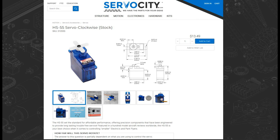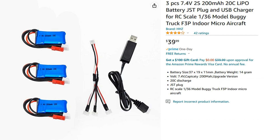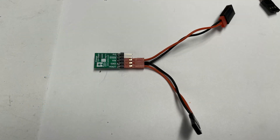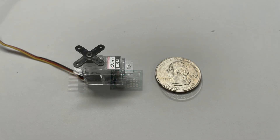The voltage regulator is really neat. My friend Burger Devil Lapinia helped me design this system, but unfortunately I probably won't use it because it ended up being too light to get the CG right. Here are the lipos I used — really cool little bitty lipos from Amazon. The voltage regulator takes it from 7.2 down to 5 volts. It's really tiny, but it's almost too light. I have a Castle 10 amp BEC regulator that I'm probably going to use to get the CG right.